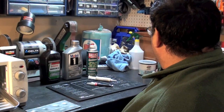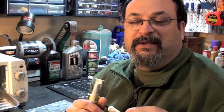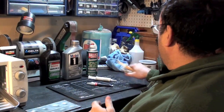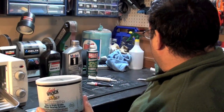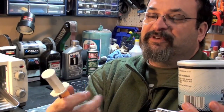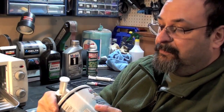So what did do good? Well, Pro Gold lubricant, TW25, and as far as these other ones, the only one that I have reservations about is this gun slick turning to liquid. That tells me if you're shooting the gun, bang, bang, bang, getting it really, really hot, this stuff could just leak out like an oil. Now these other two I would say did average, and this high temp bearing grease performed on par with the Super Lube, and this other, I keep forgetting the name, I apologize, the Montana Extreme. So it did about the same consistency and everything.